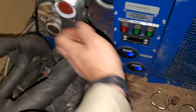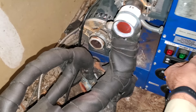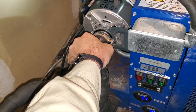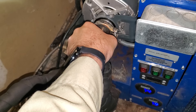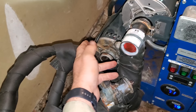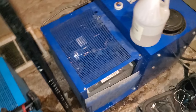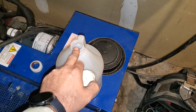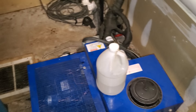One unit's not plugged in — that's why it wasn't running. This one's not ran through the switch for some reason. It's running now and it's cool — it's pumping like it should be. I can feel it because it got cold all of a sudden. This one is worn out, and that one's worn out. I brought one pump and motor assembly with me, so I know for sure we need to change that one. Both of these have a fruity smell, so it is propylene glycol. But this right here doesn't have a fruity smell at all — this is pretty much pure water, I bet. They probably added water to these is my assumption.